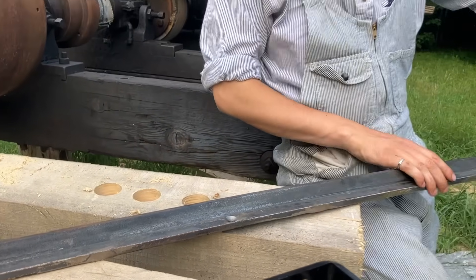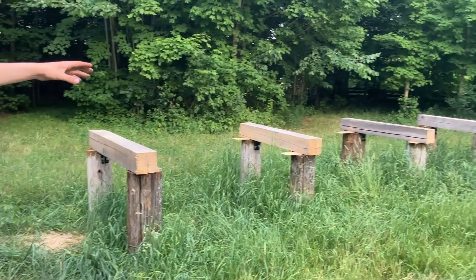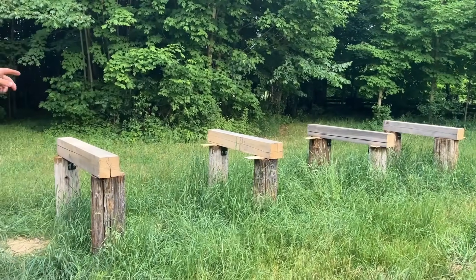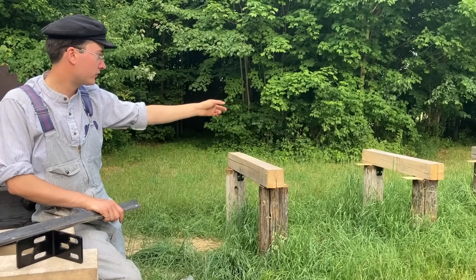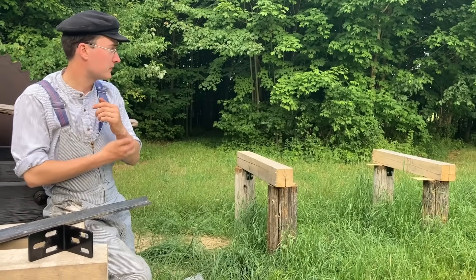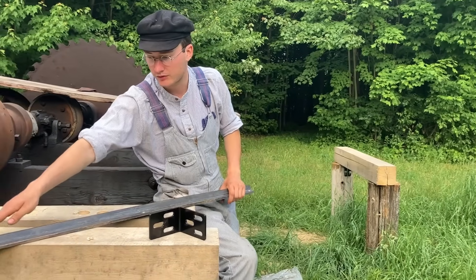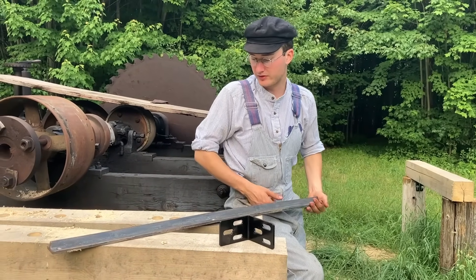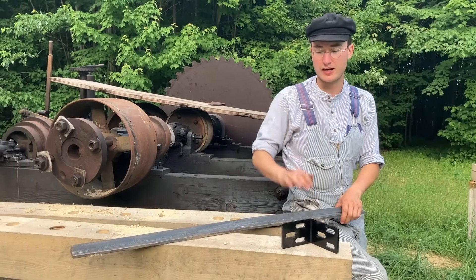The cross sections over there, where the track will sit on top, is 50 feet. So I need 100 feet of 6x6 to make up the two rails, and the posts are every 6 feet spacing. So these 4-foot rails, as long as I overlap them on the cracks in those long wooden rail sections, it should be alright. Guide rail on one side and then just a flat strap on the opposite side.